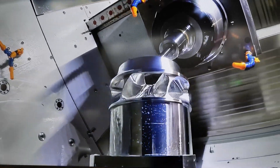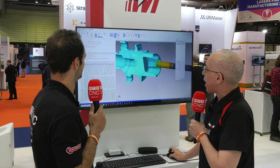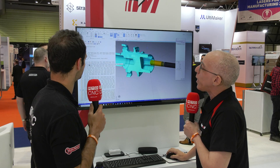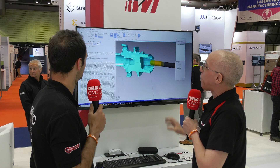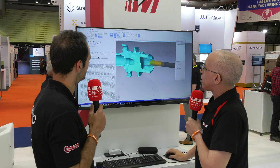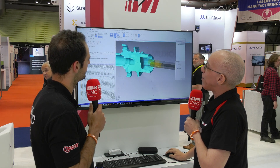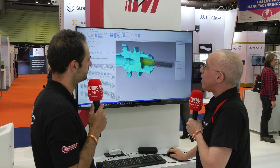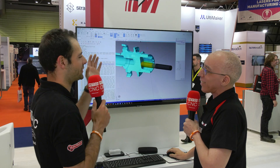Okay, show me how it works. So we have a little example here, a mill turn example. This toolpath — I've just sectioned off the model so you can see a little bit of machining. We're demonstrating the dynamic opti rough machining. This one's based on a prior stock model, so we've done some machining already, and this one's just spiralling down into material. I would have you drill this first — yeah, to make a pre-drill hole — but just for the sake of the demo.